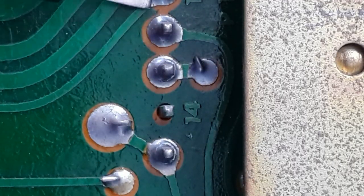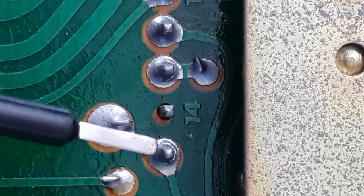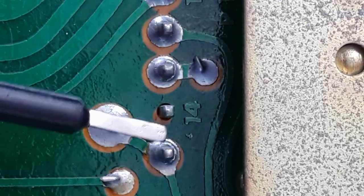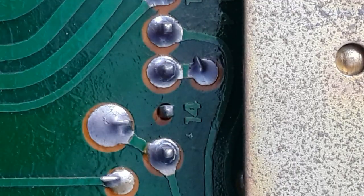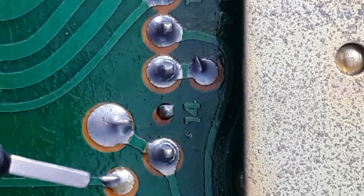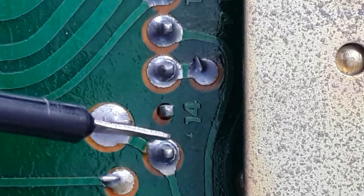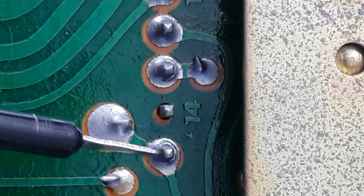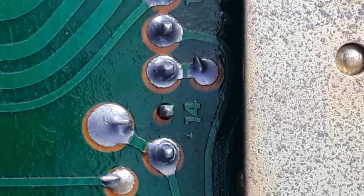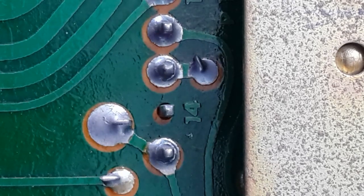I found a lot of broken solder. As we can appreciate here, just look around this pin — and this other one too. We have to check the other side where this port is connected. Those are L-kind pins turning 90 degrees, and you'll see the same situation on the other side. When you find a problem like that, don't think about replacing just one — you have to retouch a lot of solder. This oscilloscope got a lot of use. It is a portable oscilloscope for its time at eight kilos, and it used to travel in baggage rolling on sidewalks everywhere — and that causes a lot of damage over time.